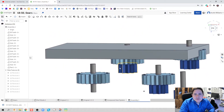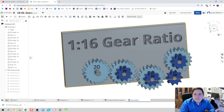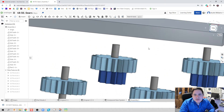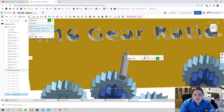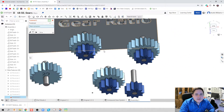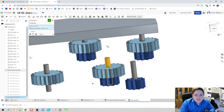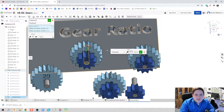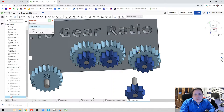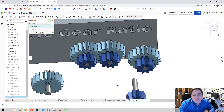I'll move the plate a little out of the way and go to the front view. I'm going to do fasten mates — fasten the first gear set to the center of the plate, since it'll be my center gear. Then I'll fasten the next one, passing it to the center of the plate with an offset of 2.25 inches — whatever distance between the two gears I need. Hit the green check mark and we're looking good.